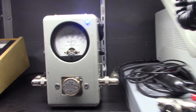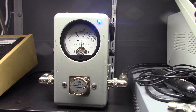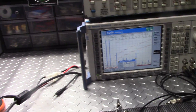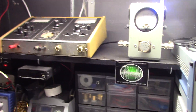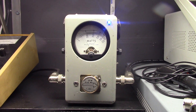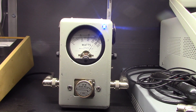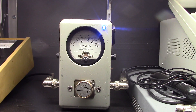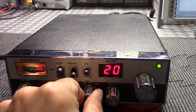There she is on the meter with the tone — it's a 25-watt slug, doing just under 10 watts on the tone. I'll show you what it's doing with the voice on sideband: one two three four, hello hello hello. It's doing right around 17 or so watts on sideband. We'll go back to AM.